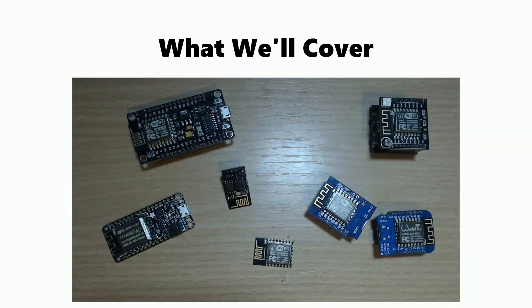After you're finished following the steps in this video, you should be able to program any ESP8266 based development board — I'll link to a few of my favourites in the description below. Two devices you won't be able to program though are the ESP01 module and the standalone ESP8266 module, because these require an external programmer. For beginners you're much better off sticking with a development board.